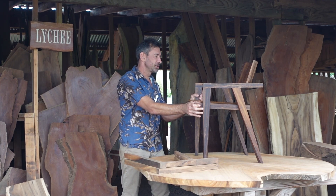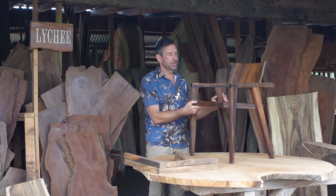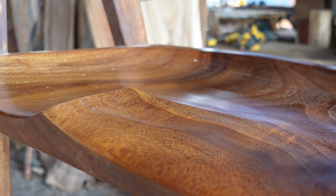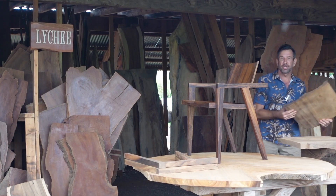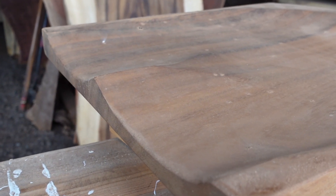There are a few technical challenges in making a chair. One of the things I think that makes a huge difference is to shape the seat. Just a bit of curvature in the seat makes it so much more comfortable. We start by cutting out a blank for our chair seat and then using a grinder attachment and a polisher, we shape the seat like you see here.